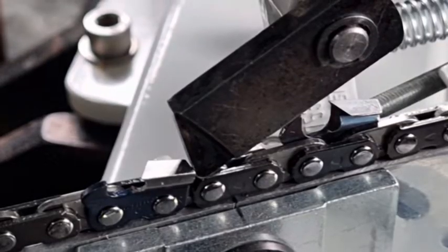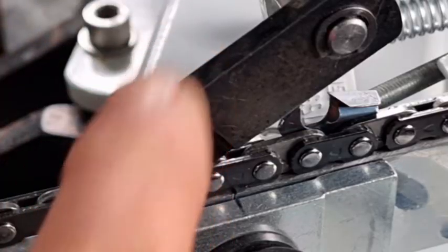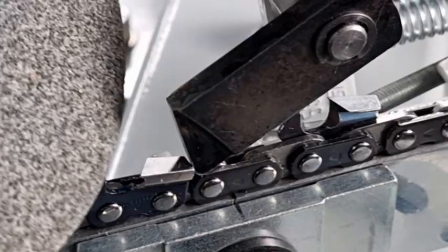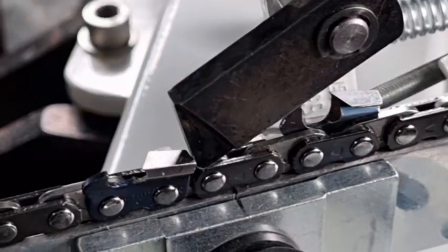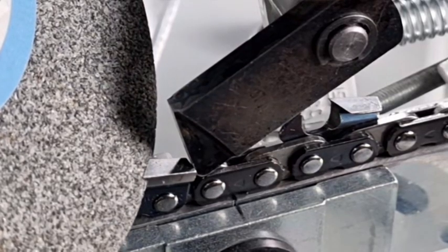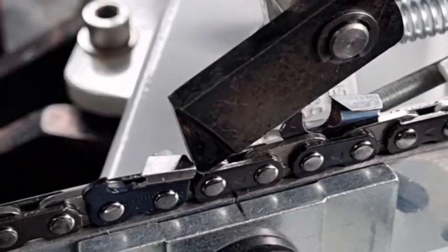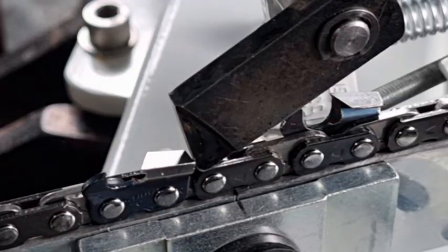We've set this up — A scale is 40 degrees right, we're doing the left-hand tooth closest to the operator, so we push the B scale back to minus, it goes back in that direction when we bring the grinding wheel down. It fits like a hand in a glove. This is a brand new Stihl RS chain, and the 30-degree top plate angle is in perfect alignment with the wheel. The tooth is only a few millimeters off the center line — just a few millimeters of offset grinding. There's a little bit of tilt built into it.